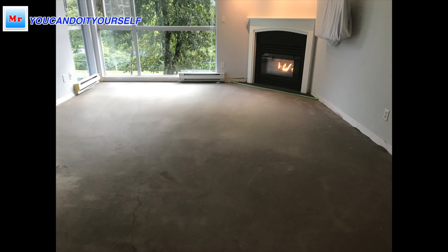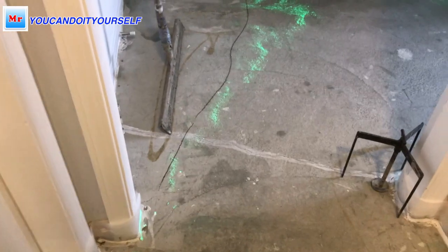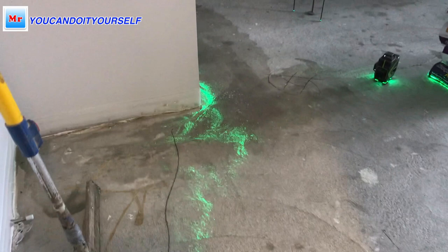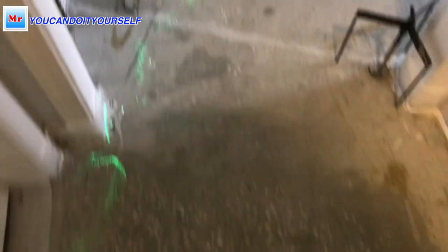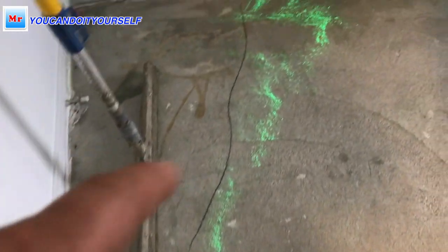This is already done. The hallway between the living room, the master bedroom, and another small bedroom was a little bit higher, so I ground it down. Then I put a 4D laser level — you can find how to use it in previous videos — and found the highest spots. The highest spot is shown in green.